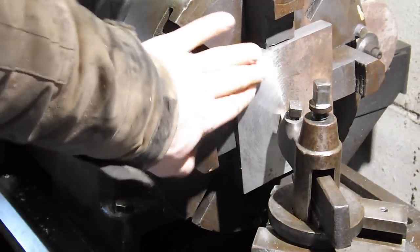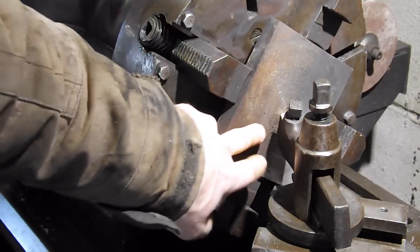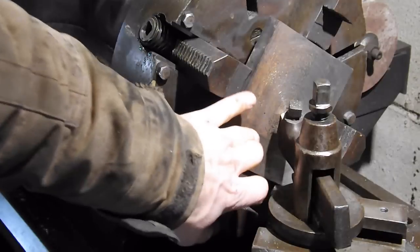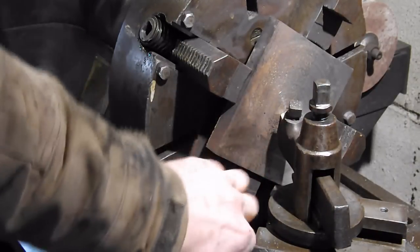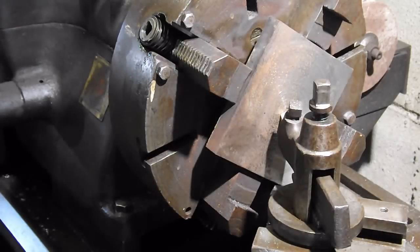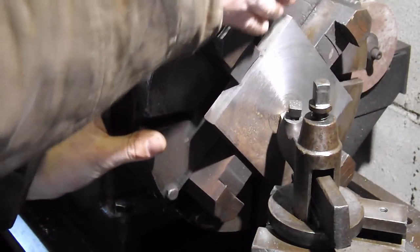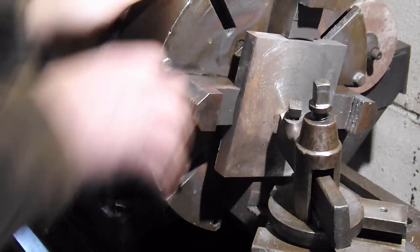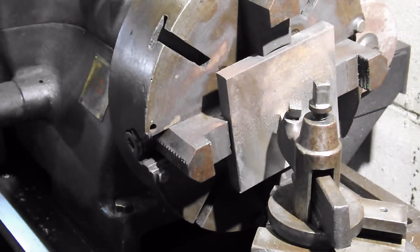One side of this is definitely a lot higher than the other side of that. Man, looks like I gotta take another pass. It was skimming the rust off though. I can see where it hit a lot of that. Right through here, about 2 fingers wide, is about the only place I can't see machine marks. Not sure what the camera picks up, but looking behind the metal, it looks like it's sitting right. I don't see daylight behind any one of the jaws. So that piece of metal is just off that much.